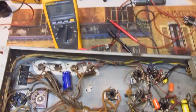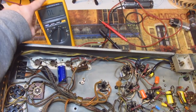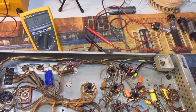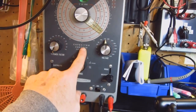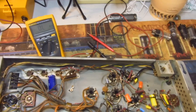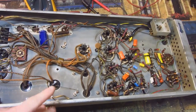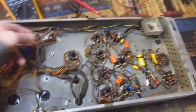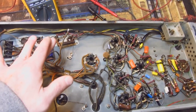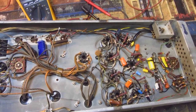Here's the test setup. We have a Fluke meter on resistance, and I'll show you how this gives you an idea you may have a problem, but you might not spot it with something like this. What you really need is an insulation resistance test. If you have a high voltage capacitor checker such as this Heathkit IT-11, or one of the 450-volt models, even that'll work fine. You test the transformer just like if it's a capacitor — testing between any of the windings and ground. In this output transformer, nothing is grounded on the primary; you have two plate leads and a center tap. There should be no continuity at all between this primary and the physical chassis. If you do, you're getting insulation breakdown somewhere, and that's what's going on here.